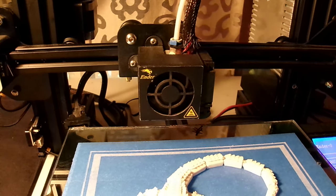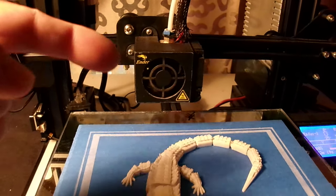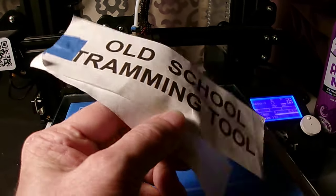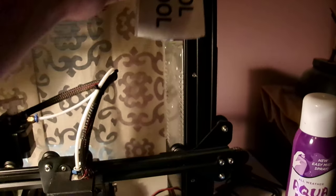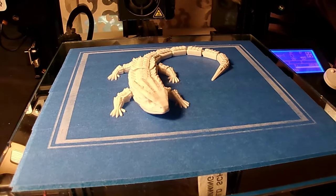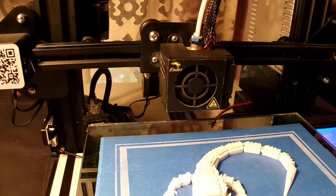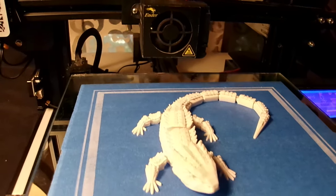No so-called upgrades, no electronic gizmo — because when I print in this fashion, this is all that's required. It's amazing: a piece of paper, a two-inch by six-inch strip of paper — that's the tramming tool. Once it has been trammed on a known-to-be-flat print surface, an electronic gizmo has nothing to compensate for; it's virtually useless. Knowing that, I figured why bother.